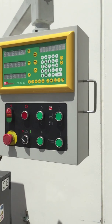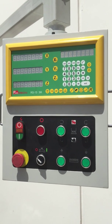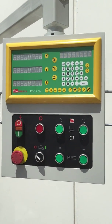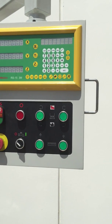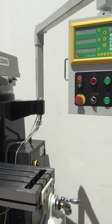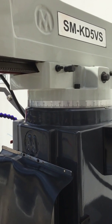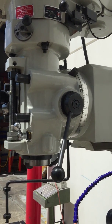On our main control, just over here, we have power up and down of the table, so it's all nicely positioned there on the right hand side. We've also got cutter rotation, coolant on and off. Our head, as you can see there, with our lovely Meehanite casting, rotates 180 degrees, and also swivels left and right, just up there as well.